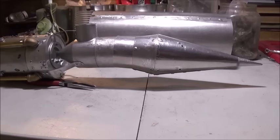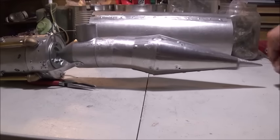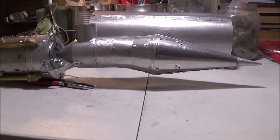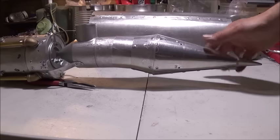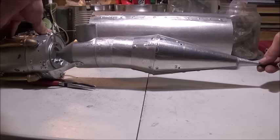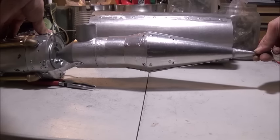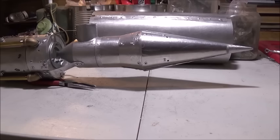Here's what it looks like with the intake spike sitting on the intake cavity, hooked up to the spring. You'll notice there's a downward lean to the intake spike — just like the original SR-71's intake spike — it has a downward lean at rest. That's because it's on the spring. As velocity increases, pressure against the spike is going to start lifting it up and pushing it further and further back, and you'll notice it straightens out — the aerodynamics are going to be nice and in line.